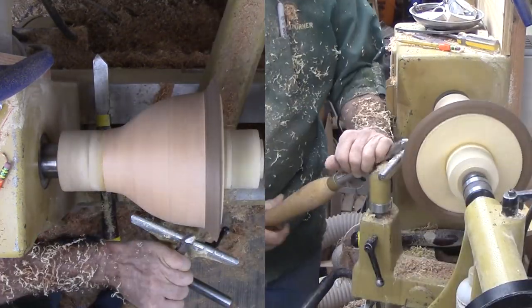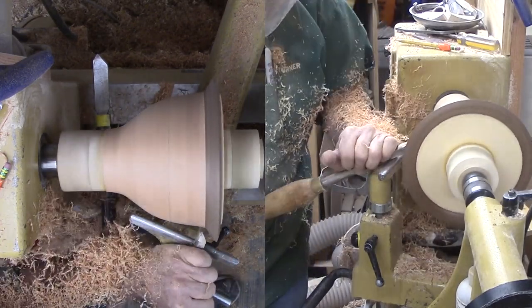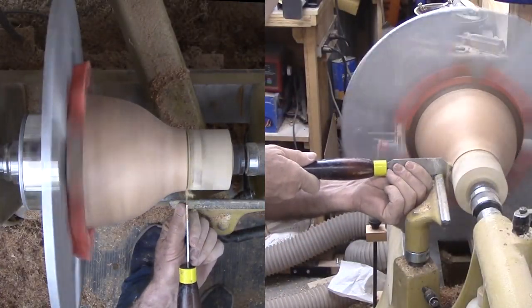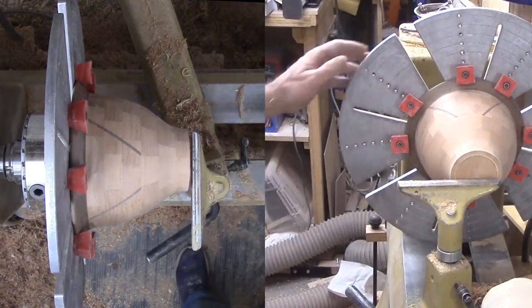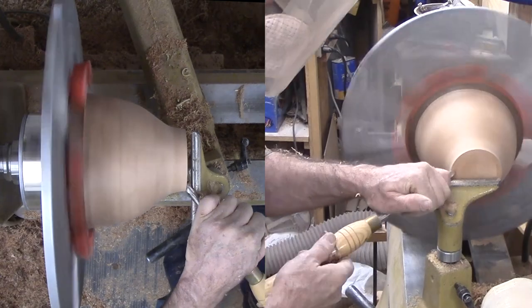Then a final trim to the exterior. Most of my cuts here are shear cutting with my bowl gouge. Then a thorough sanding inside and out. Finally the foot — the base is still mounted to a faceplate and the top is in scroll jaws. The live tailstock chuck adapter removes the typical excitement after severing the last few grains. Then finish and sign the foot.